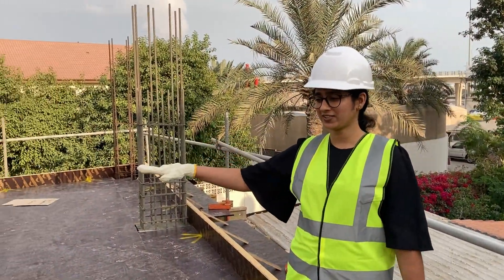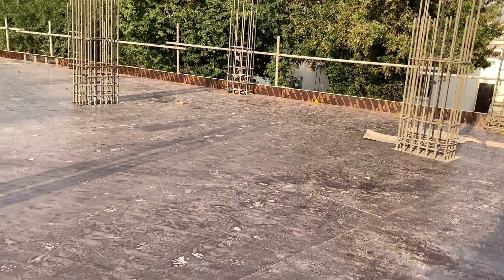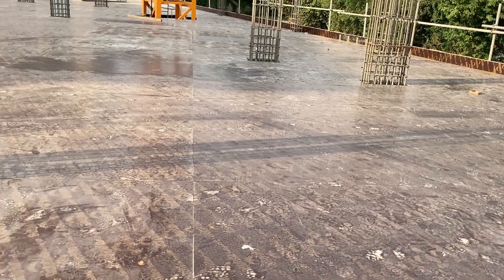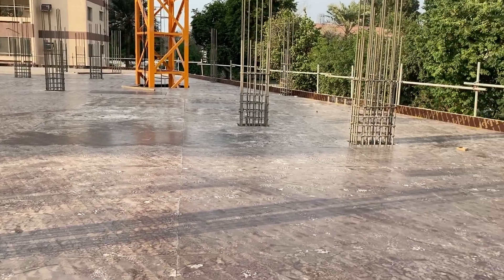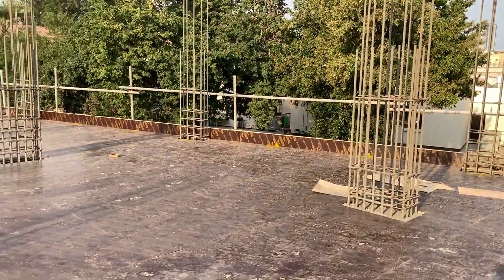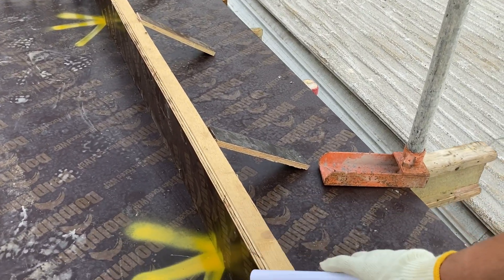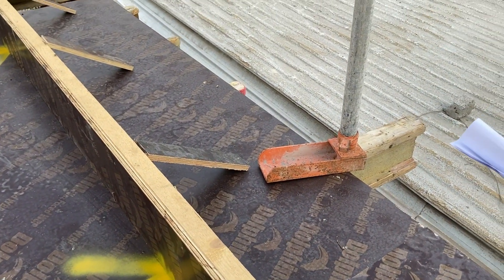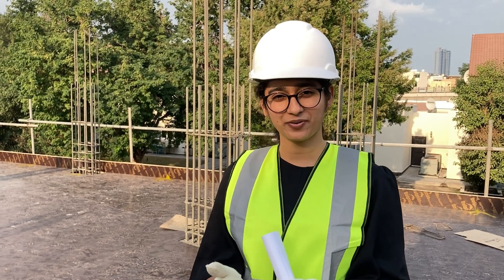This is the finished top portion of our formwork. You can see the surface is leveled — we need a clear, leveled surface for concreting. In this project we have the same level throughout, so before casting the slab we make sure the level is consistent. We have concrete stop ends installed and a working platform with a handrail, though it is not finished yet. In this video we discussed the erection of the cup lock system. In my next video I will cover the PT slab work. See you in the next video — bye bye.